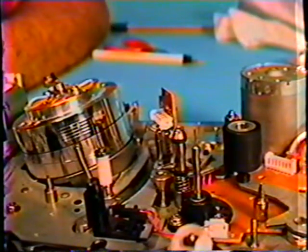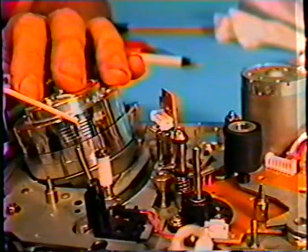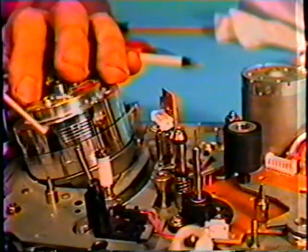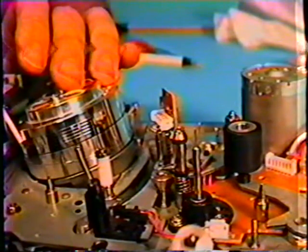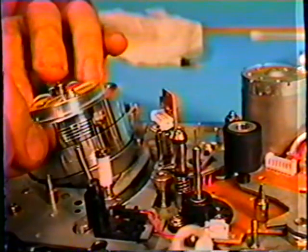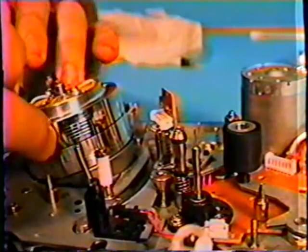Remember talking about that tape that was cold? Yes. I had a VCR one time where the tape oxide peeled off of the tape and fused itself onto the drum assembly. I mean, you could turn it, you could see the shiny metal, and it was just black from here to here. And that happened in the extreme cold climate of Minnesota. And did it come off? It finally came off. What I had to do was to soak my rag with alcohol and just soak it and rub it and soak it and rub it. Took my fingernail and actually peeled it off. Had to scrape it and peel a little bit at a time. But again, being extremely careful. You do not want to get on the active element of the head.